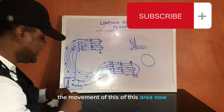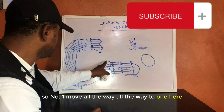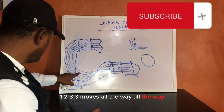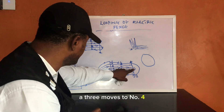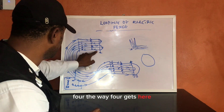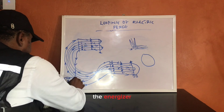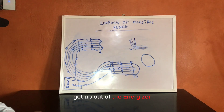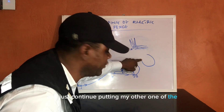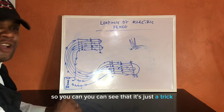So now, following the arrow of movement: the current leaves from the out, goes all the way to number one, then number one moves all the way to one on the other side. Three moves all the way back, then moves to number four, four returns all the way, gets to six, and from six it moves and hits the energizer return — completing a full circle.